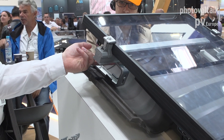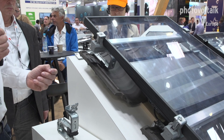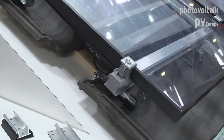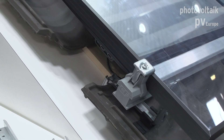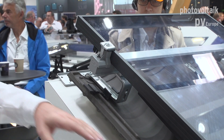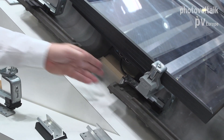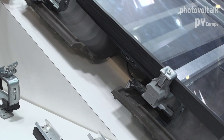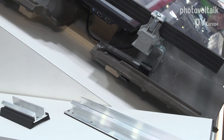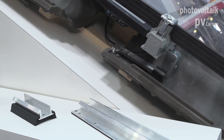We're using click connections — this rail here is an aluminium rail which is clicked into this clicker. We use only one tool, which is a Torx 30, for screwing the universal roof hook either to the rafter, as shown here, or we hang the universal roof hook behind the batten. This is an easy and very fast way of installation.